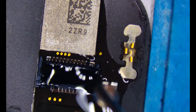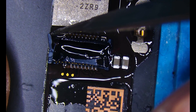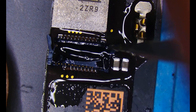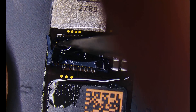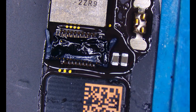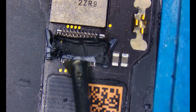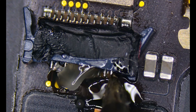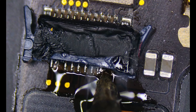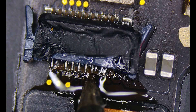I'm going to add some isopropyl alcohol to help loosen the adhesive, and I'm also going to break these legs and push out the actual flap portion of the connector, because this plastic melts so I'd like to have a backup just in case the replacement breaks. We'll dry up the alcohol, add some flux, and taking my soldering iron I'm going to carefully go on each one of these pins and pop it away from the solder pad.